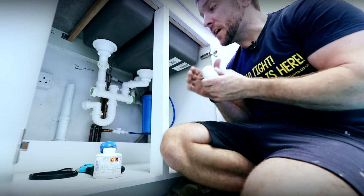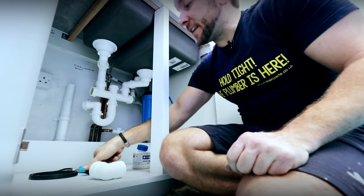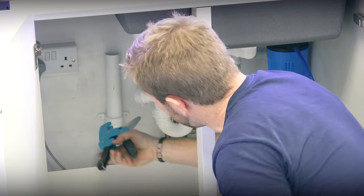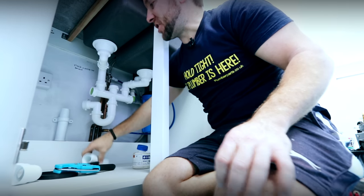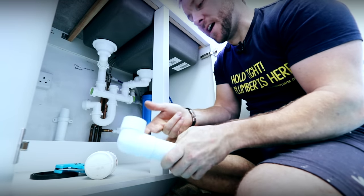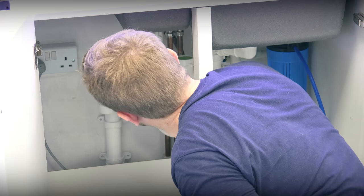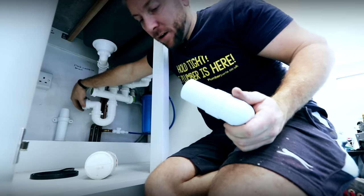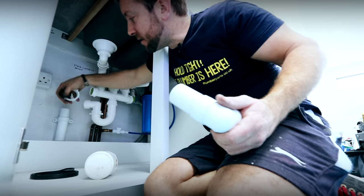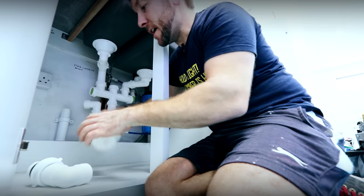For those of you who don't know, we're going to use solvent weld on this - we've done videos on how to use solvent weld on our channel, so have a look there. What we're going to do is, because I've got my elbow here that we're going to be going down into, I now know exactly where I need to cut this pipe. Plenty of splodge on that - put it on, give it a twist, that's what I always do. Wipe off with your finger, make it look beautiful. And then I can marry this up to that and know exactly how far I need to cut this. I always take off this piece and the rubber o-ring, and then I fit everything together with it fitted round here - it's just the way I do things.